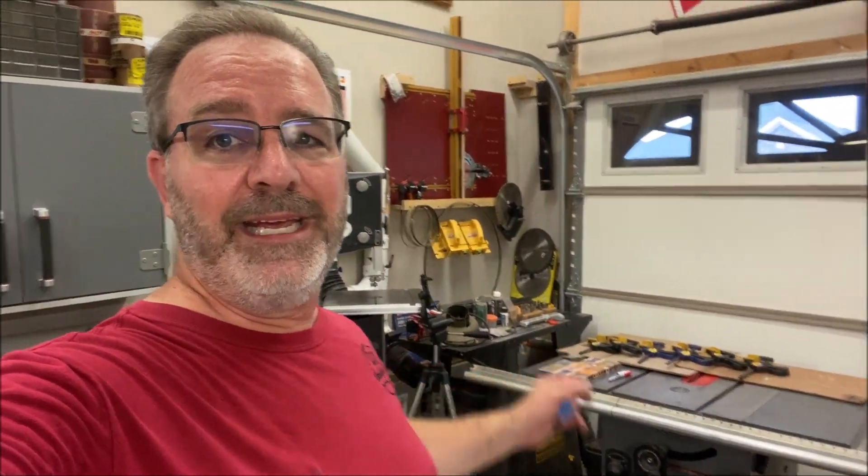He has a video series that I bought a while back — I don't know, three or four hours worth of video about segmenting — and he builds special segmenting sleds that he uses on his bandsaw. He assembles his blanks, and in the video I saw he was making something like a junior gent, and basically he glued the tubes in with Titebond. It held, and he said he has good luck with it. I thought it's going to be a lot easier than using epoxy, because epoxy is going to be difficult to mix up enough to do the entire blank, squash it, then mix up enough for the next blank. So I'm going to attempt to do these with Titebond and I think we're going to be in pretty good shape.